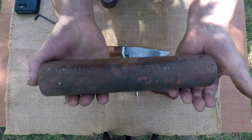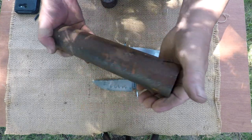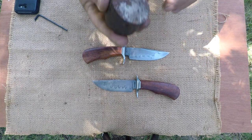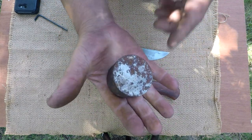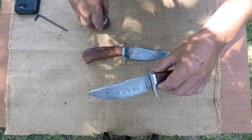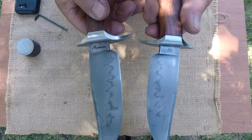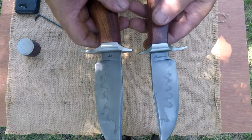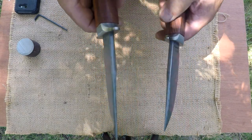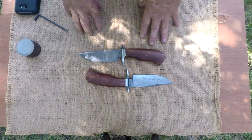This is where the steel for these knives starts. Look at that. I can't see how big around that is. This is W2. And what I do is, I'll cut a wafer off the end of that bar, and this is what I forge down to make this. And anyway, we use it because it's a real shallow hardening steel, which will result in what's called the hamon. It's a differential hardening. It's a transition zone from hard to soft, and it always has unique characteristics to it.